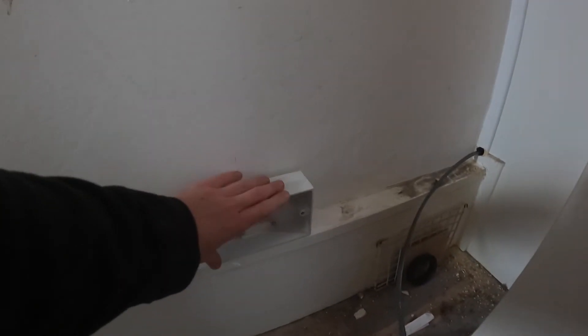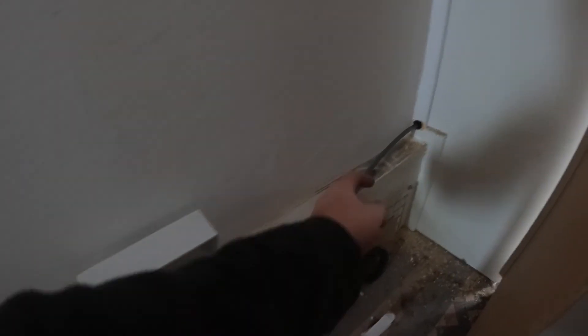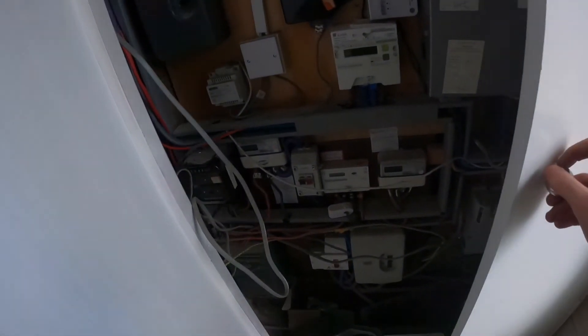The client has also asked to wire in a double socket just as a cleaning outlet because it's a communal building. I've just been asked to wire it in surface mounted. So I'm going to put the double patress here, put a piece of mini trunking and a gland here into my box. I've already drilled out my hole there. It's not getting terminated up at the minute because there's a bit of work to get done in and out of this board, but I've just left my cable coiled up here. It's a bit of a mess with everything going on. That's tails with bare copper ends on — I've checked them all live, but still not good enough.